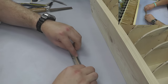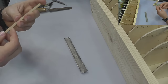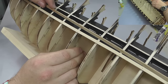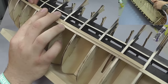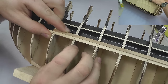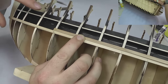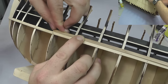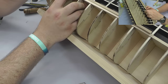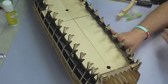We're trying to keep the chamfer equal. Maybe I'll just do one end first to show you. We've done that — just a little bit, it might need more. As we go up, different parts are going to need more chamfering than others. But as you can see now there's a bit of an improvement in the way this is sitting up against the ribs — we've closed that gap a bit more. That's what we want: a slight chamfer in there, getting rid of the gaps so it all goes with the curvature of the hull.